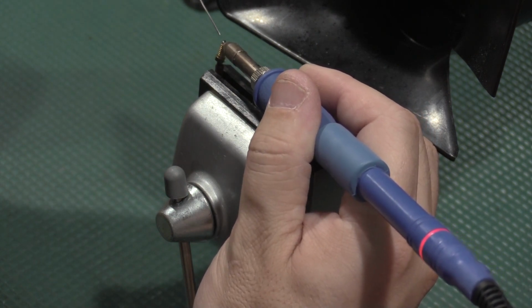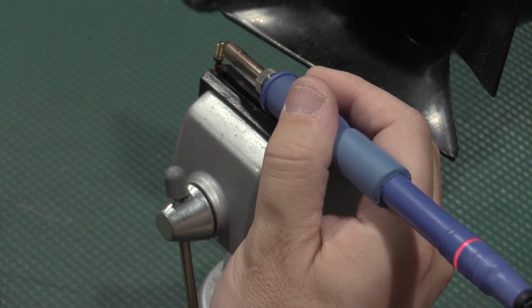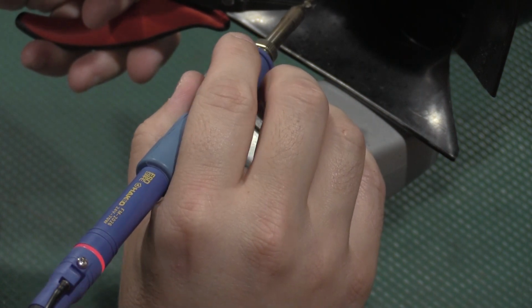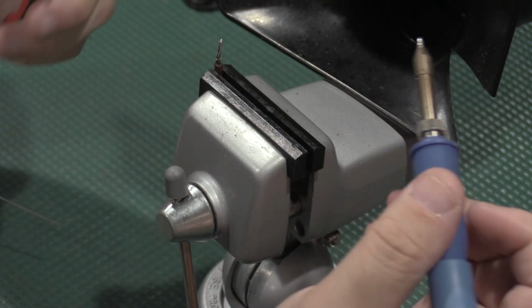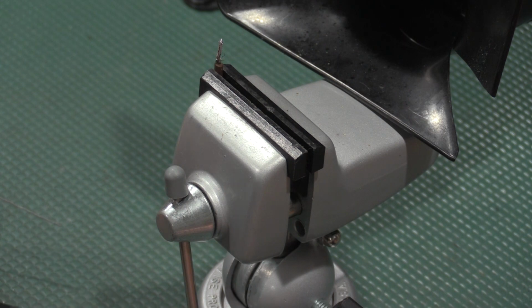However, the N2 does have a purpose in the lab, and I really put it in to start working on the Tektronix ceramic strip units. I'm paying attention, not getting burned, so I'm trying to talk while I'm soldering, and that's not a good idea. It really makes the lead-free solder behave better when I'm doing ceramic strip soldering. The other thing that the N2 really does when doing surface mount work is it acts as a preheat for the board, and can make things just behave a little bit nicer.